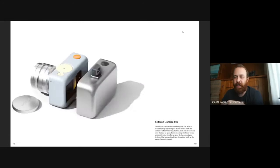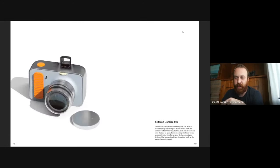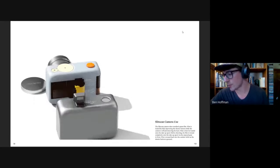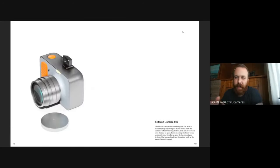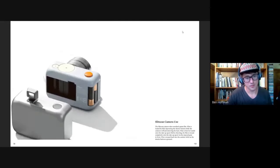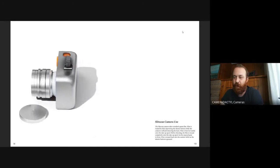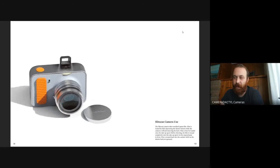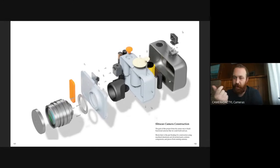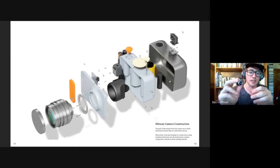Are we talking stepper motor or continuous DC motor? That is a good question because I cannot remember anymore which one of them it is, in relation to a 35 millimeter film can. Mm-hmm. I think it would be very hard for you without a servo or a stepper to accurately position a certain number of turns with a small DC motor, because that motor is going to change its properties over time. Yeah, I got it here.